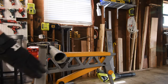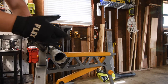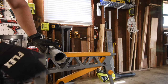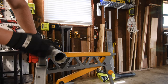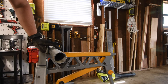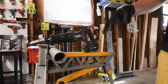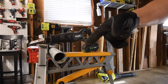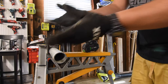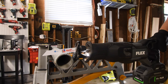The last test — let's cut metal. When it comes to cutting metal, I only do a couple of cuts because a lot of reciprocating metal cutting blades don't last that long for a good reading. After about three or four cuts, the blade gets so worn out that the fifth cut is going to take forever compared to the first cut. So we're going to do four cuts each and see what the results are — we've got brand new blades for each of these tests. We're going to add three cuts together, then time the last one against the Milwaukee's last one. Orbital feature on metal is useless — you do not want orbital feature on metal, that's just going to completely destroy the blade.